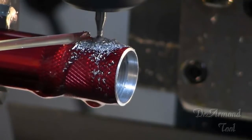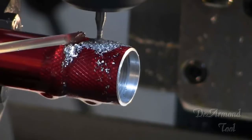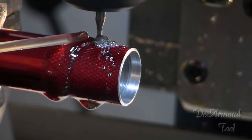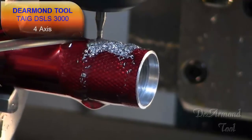Since we're working on a pre-finished part and cutting through knurling, I've added a light cutting oil so that the finish will be bright and clean down at the bottom. On parts like this we can't do any refinishing or repolishing once it's finished.